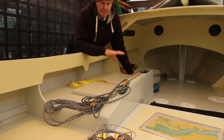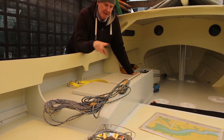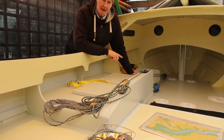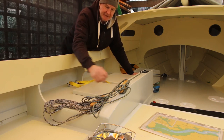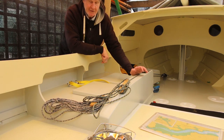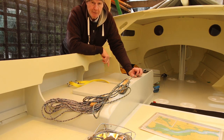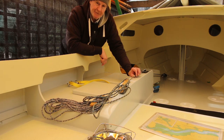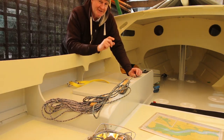While we're showing and telling the side of the boat, I'd just like to show you a couple of the small technical details. I've built the centerboard raising tackle. That's in tension, on this cleat, and that's in use. And if you're wondering what this line is, it's its opposite, which is the centerboard downhaul line. And the reason I've got that, two reasons, is I made the centerboard slightly lighter than standard.